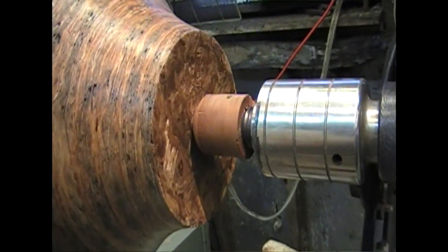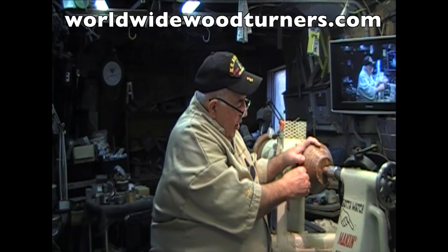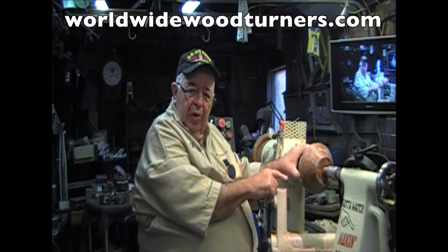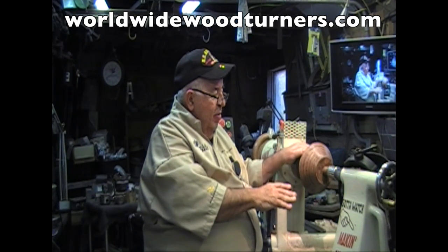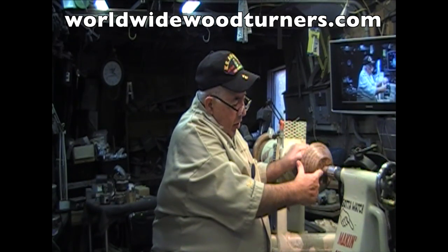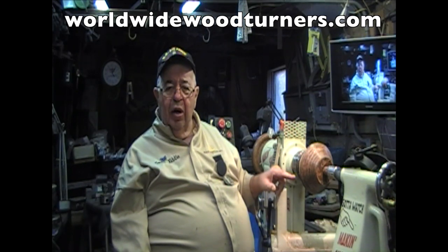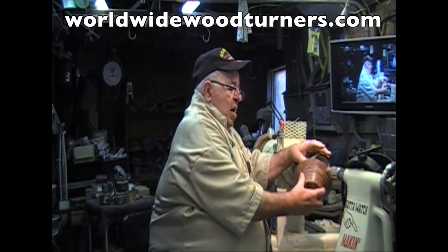But then you can put it on there, and it's soft touching it, and I can work this around. I'm looking right across this thing here, and I'm going to see the highs and lows. And remember, I'm just coming in to clean it up and sand it. So I'm going to bump it around a little bit, and then put a little more pressure on my soft touch. That is not going to mark my lumber, or my turned piece, or whatever. It's going to put a little pressure on it, so now I can turn the machine on, and I can sand this, I can finish this, I can trim this, and I'm going to have a little bitty nub at the bottom. I'll take that off with the knife later. But that'll hold it. And that's for reversing. Okay? Now, let's just say I've got another piece.